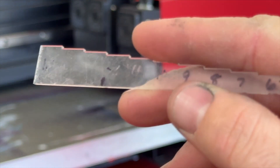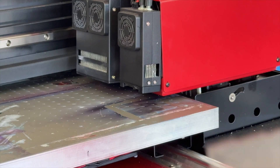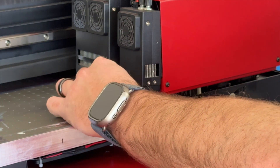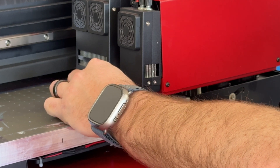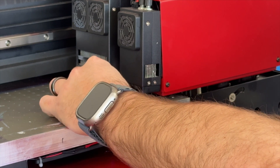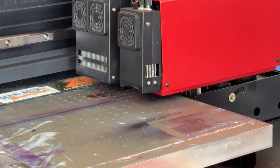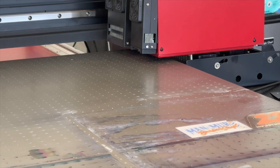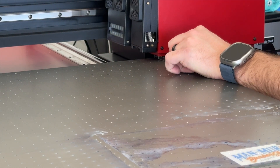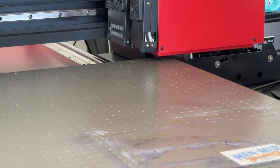To start, I have a little focal gauge that I made out of acrylic for my laser. I'm going to measure off the five millimeter mark here at the front, and then at the back, to see how far off it is, and then start adjusting from there. At the front of the bed, it just slides in and out from under it — good. But when I pull the bed all the way back, you can see there's a pretty big gap — it's about two to three millimeters off at the back compared to the front.